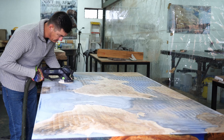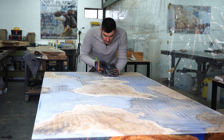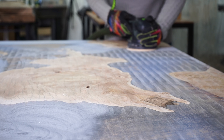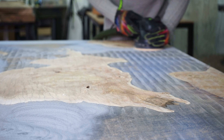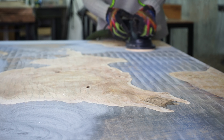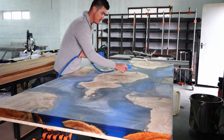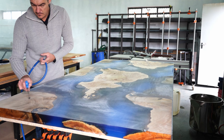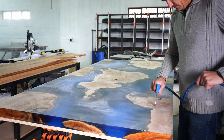Having the table back in the shop, we're going to start sanding with our Festool Rotex machine in the Rotex setting. The Rotex setting is like a belt sander setting but not as aggressive. This step is to remove all the CNC lines the machine made — you'll see there are so many lines on the table, and the 80-grit sandpaper is going to remove all of them. This step is quite critical for the next step in our build.